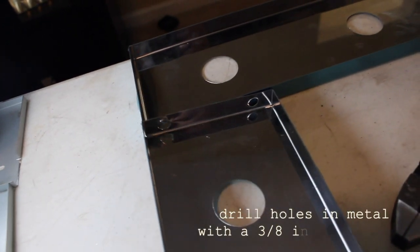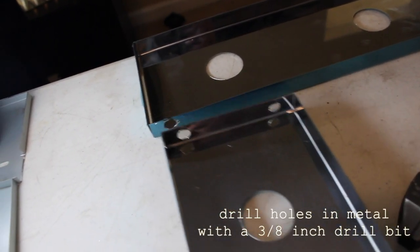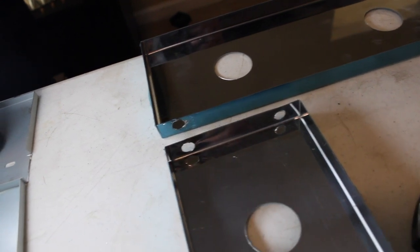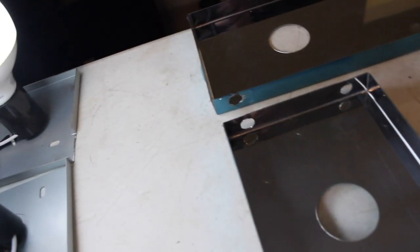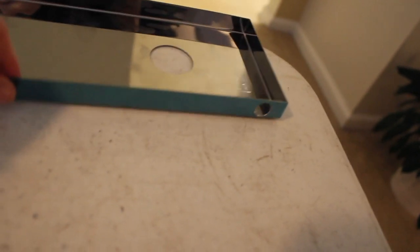We realized that the edges of the vanity bars were pretty sharp and we didn't want to risk cutting our wires when we put the cover on, so we decided to put holes in each corner of the vanity bars and run the wires through those. This is completely optional, but we wanted to play it safe. To do this, we used a power drill and a 1/8 inch drill bit to drill the pilot hole, followed by a 3/8 inch drill bit to widen the hole.